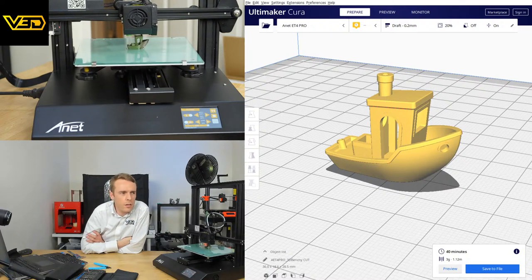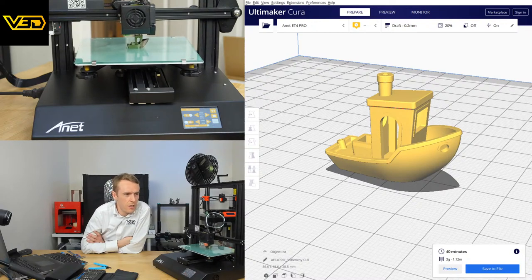I can't really remember the Sidewinder X1 I looked at quite a long while ago. The more recent was the Genius. I think the worst part that I noticed for that was that the ribbon cables were not great. I think they're not rated for particularly high current, and there's quite a lot of current going through them for the hot end stuff. But I don't remember the other parts being so bad.